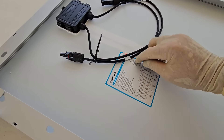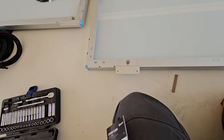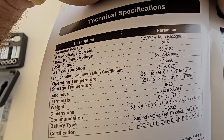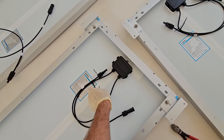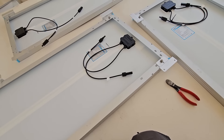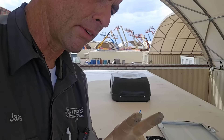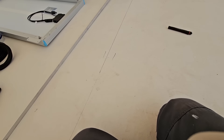These panels have an open circuit voltage of 24 volts, and the charge controller that came with it maxes out at 50 volts — max PV input voltage 50 volts. So I'm going to keep all these in parallel: positive, positive, positive, negative, negative, negative, using some Y-connectors. One of these panels is going to be all by itself as a 100-watt panel for the other charge controller. If I put two panels in series that'd be about 48 volts; three in series we'd be way above 50 volts — the math works out to 72 — so parallel it is.